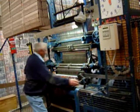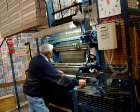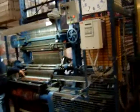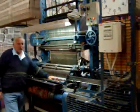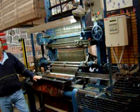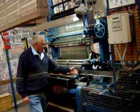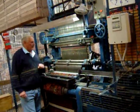But more importantly, on his way back, there he's making the trip back. We've got a couple of inches to go. We've left behind a double shot of jute. We call that the binding shot or the binding weft. It can only go one place. That's right across the centre of our yarn, and that's what ties or binds the yarn into our weave.